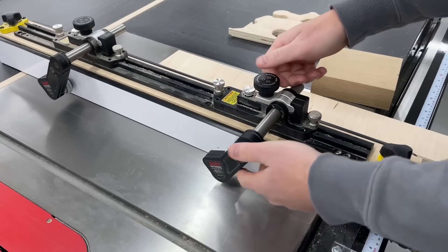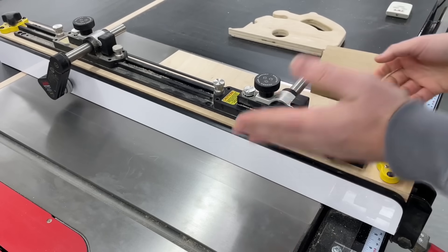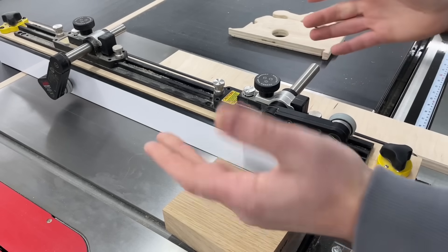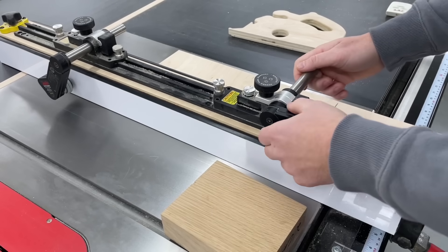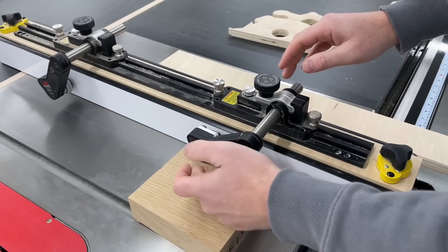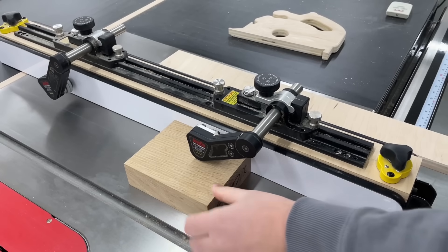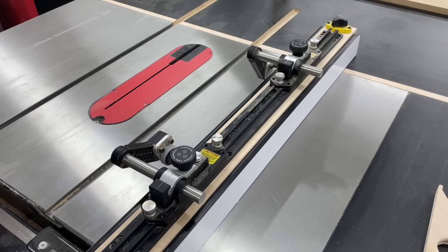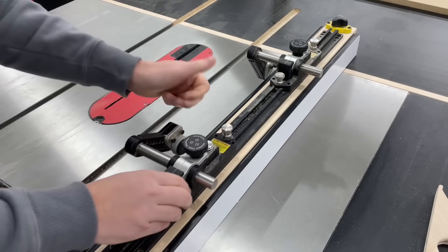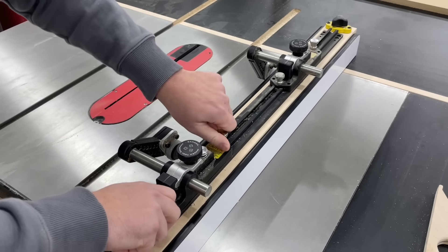As you can see, it's quick to get these up out of the way — just the big knob right on top. They store out of the way right up on the fence, and setup is real quick as well. Whatever height you're using, you'll just take this and set your wood right under the metal part there and lock it down. When you run it through, the wheels will engage exactly where they should. The guides come on a track, and with just these two knobs you can adjust their position. I just keep one in front of the blade and one right behind it and tighten that down.